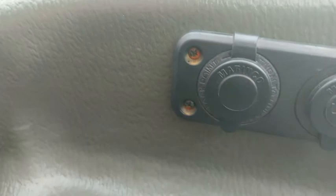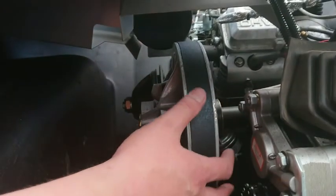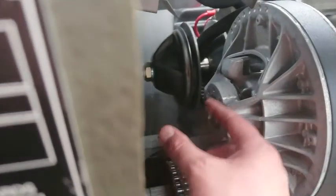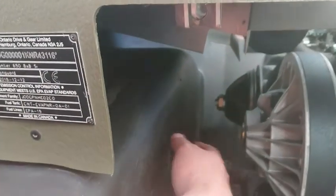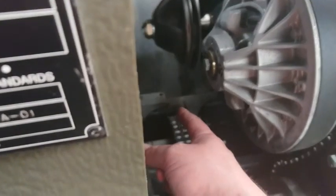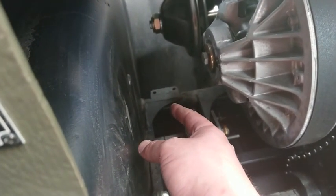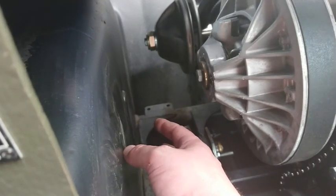The firewall is out. I can get in underneath these corners. I have my hand up under here and there's a big void beside the heat shield - that would work really well. I'm a little worried about running over the top of all this because that's our main drive belt. That's the CVT - those two pulleys pushed together to adjust your gear ratio. If that gets wet you're going to have a hard time driving anywhere. I can see the bracket down here. There's actually a bracket on both sides - I think you can mount two bilge pumps to pump either side out. I think one bilge pump would be enough to keep you afloat, but I probably should have ordered two.